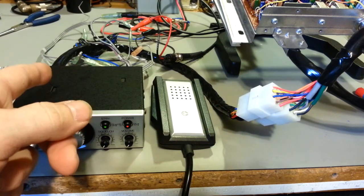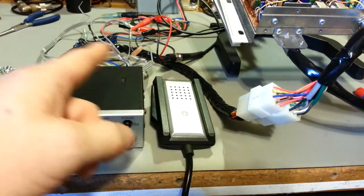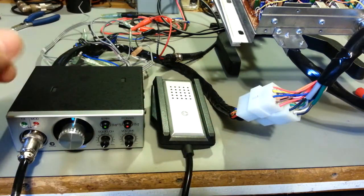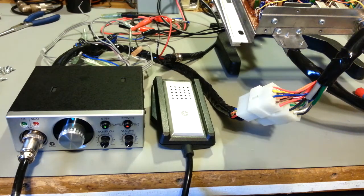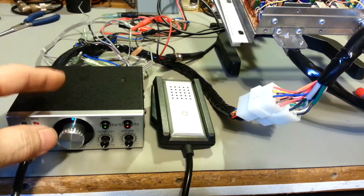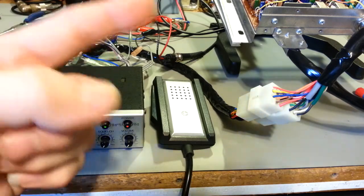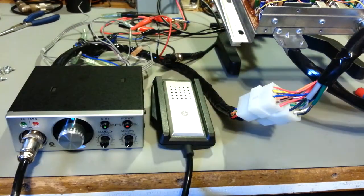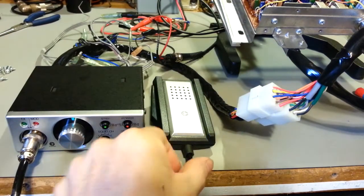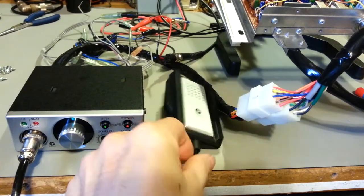You would have to probably add one wire to this wiring harness here, because pin 7, I believe, I'd have to pull the schematic. I think it's pin 7. It's held low, continuously. And that's not done through here. They just have it grounded inside the main transceiver chassis. But, yes, you know, this is a new old stock radio. So, yeah, it's literally, doesn't get any nicer.